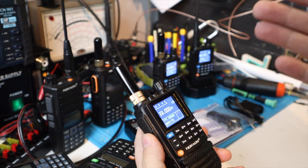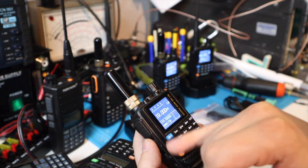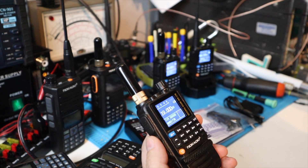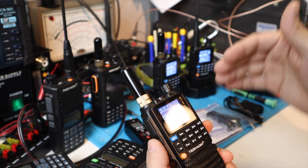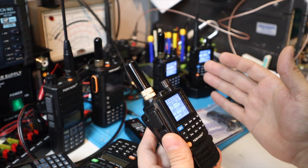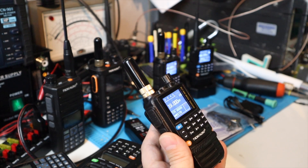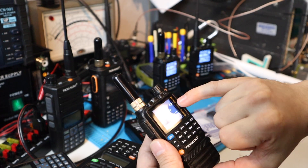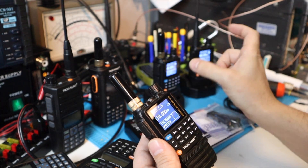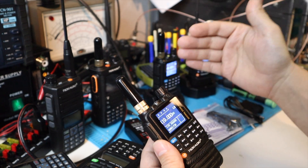One of the killer features is that it can switch over to AM mode and pick up air traffic — big chunks of the bandwidth used by your airport's tower to bring planes in and out and land them on different runways. I find that valuable, especially for preparedness. Listening to radio traffic at your local airport tells you the frequency of flights coming in. Zero flights? That's potentially good intel. You'll hear the difference in audio quality, and for safety reasons planes and airports are still using AM to communicate.